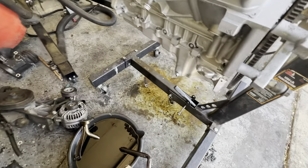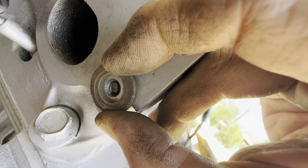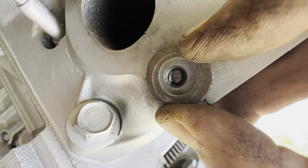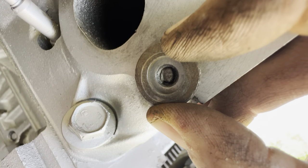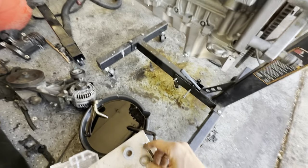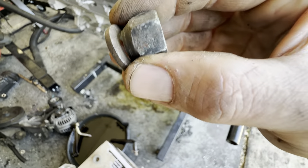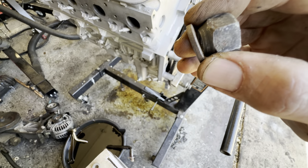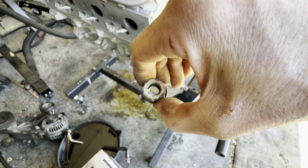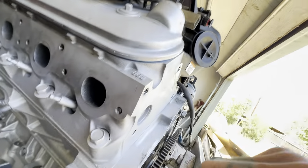That's where a washer comes in. With a washer, I can get the tip way up close and blast a whole bunch of weld on top of that stud until it mushrooms out and attaches to the washer. Then I take a lug nut, put it on top, and weld between the nut and the washer — the washer is already welded to the stud. Then weld the nut to the washer and inside the hole to the stud. Let it cool and it should just back right out.